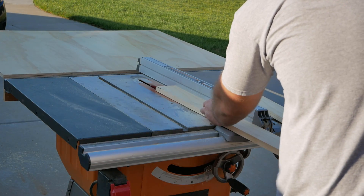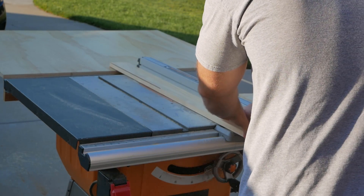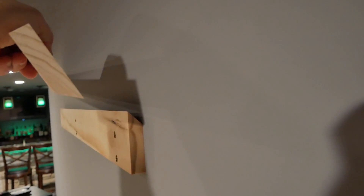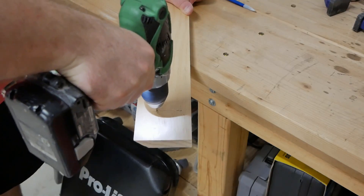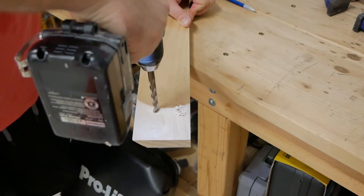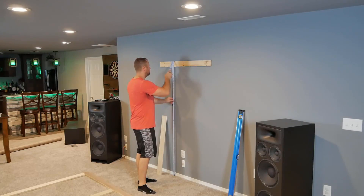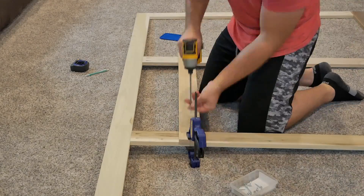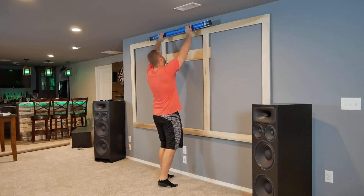To attach the frame, I'll be using a French cleat. I already had one half of the cleat on the wall from my test screen video, so I just need to cut another board at a 45-degree angle to attach to the screen. Once attached, it will sit against the wall and be held up by the bottom board. Since it needs to be flush against the wall, I pre-drilled my holes and used a larger bit to countersink the screw heads. With the frame downstairs, I took a few measurements to make sure the screen would be the correct height and attached the cleat. Take your time and be sure this is as even as possible because this will determine how level your screen sits on the wall.